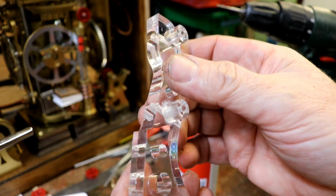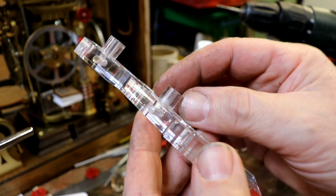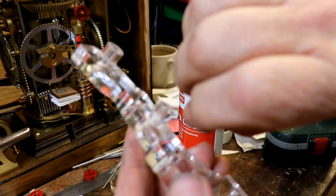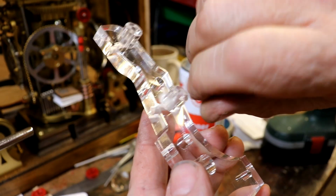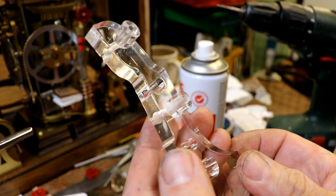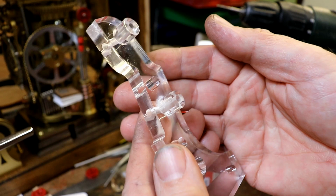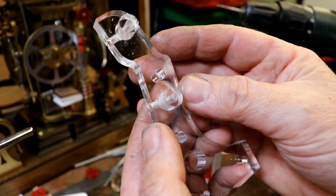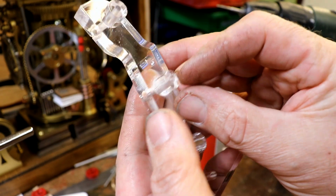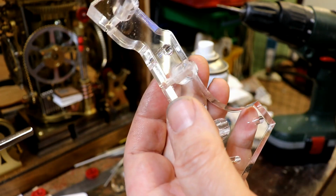If you're tapping metal, like mild steel or something, you need special cutting compound, and you need to use a tap wrench, and you turn it a couple of turns back half to clear all the little cutting slots. And you do it like that, very slowly and gradually. So obviously the worst thing that can happen if you're tapping a hole is the tap shears off. And if the tap shears off, you're completely stuffed, because the hole that you've just drilled is full of hardened steel tap, and basically the whole thing you've made is ruined.